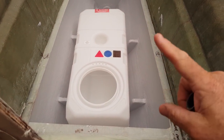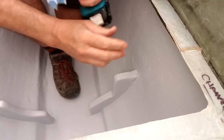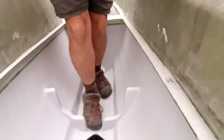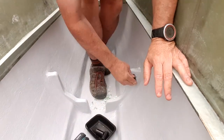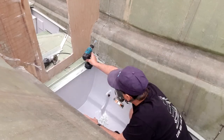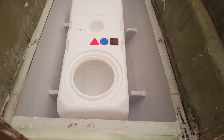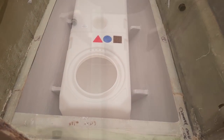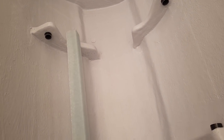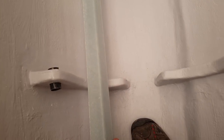That's looking pretty good now — all flow coated. I was going to simply put some stainless saddles here with straps over the top, but I've decided to use carbon tube instead. This is a 25mm carbon tube from an old stand-up paddleboard paddle that I cut up. I'm going to bore a hole through here, here, here, and here — that'll give me my tank strap mounts, and I'll just glue them in with epoxy, a little fillet, nice and neat. Then I can put some composite angle underneath — two pieces — to act as a bed for this tank. In the same vein as what I did with my fuel tank beds, I'll embed a couple of composite angles into these mounts to give the tanks something flat to sit on and avoid pressure points.